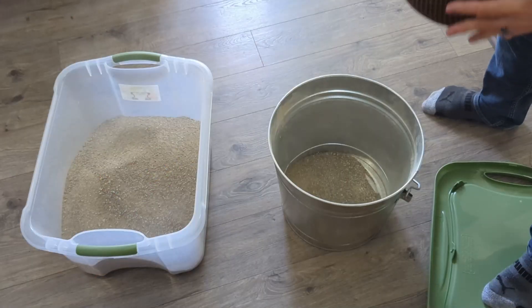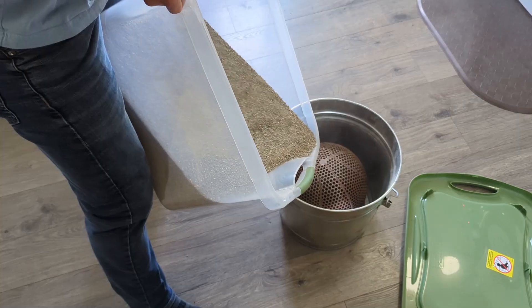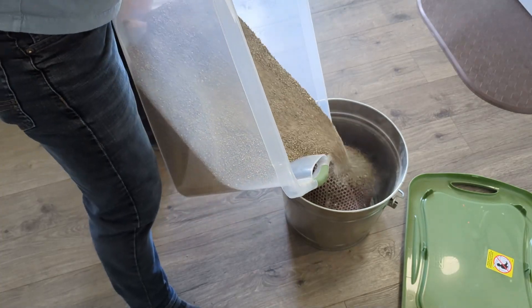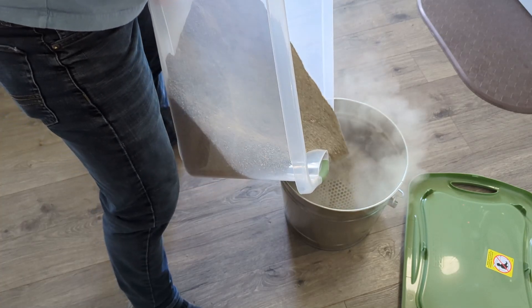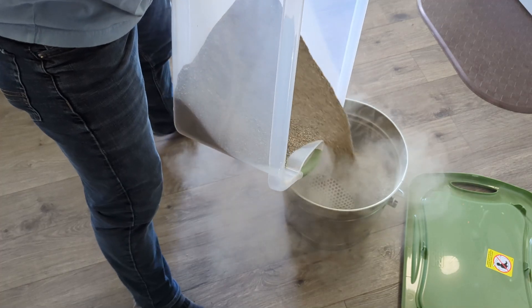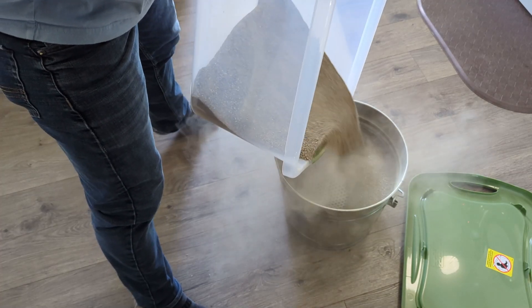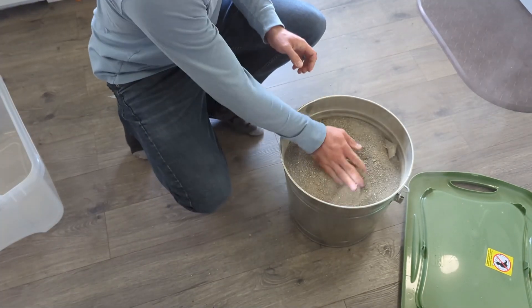Next, I had to prepare each basketball for annealing by putting it in a metal bucket and then covering the basketball completely with sand. The reason I cover the basketball completely in sand is it's pretty common during annealing for 3D prints to warp or deform because of the heat process. So by covering it completely with sand, this will help prevent any warping or deformity while it's annealing.